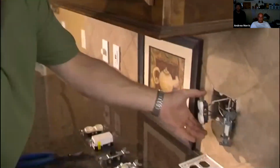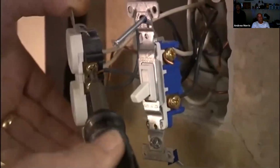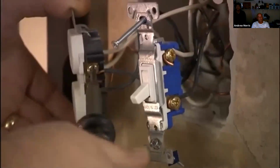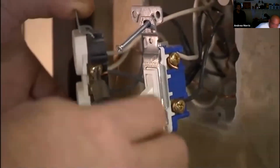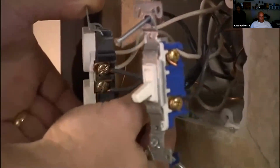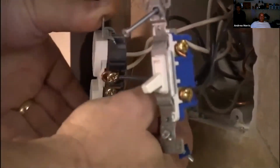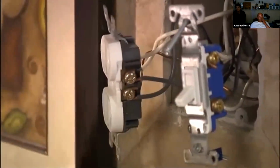So what you'll want to do is pull it out of the wall. Take your flat tip screwdriver, place it on the terminal, and turn it counterclockwise. Lefty-loosey, righty-tighty, just remember that. You want to loosen it up, so you turn it counterclockwise, grab the wire, and pull it off. Once you've got that disconnected, you slide it onto your new terminal for your new outlet.